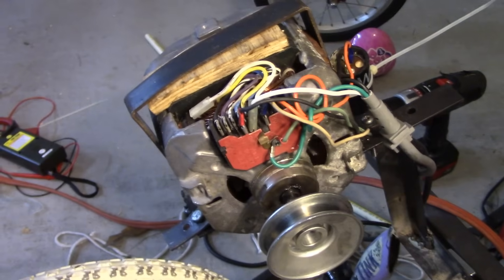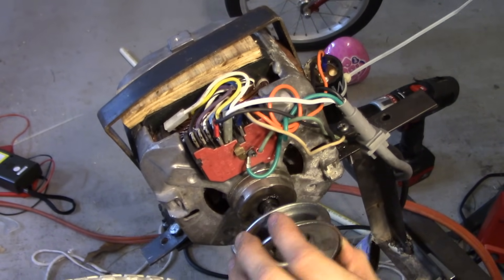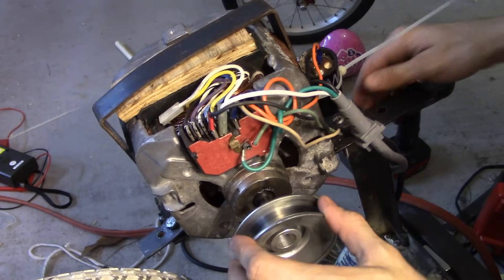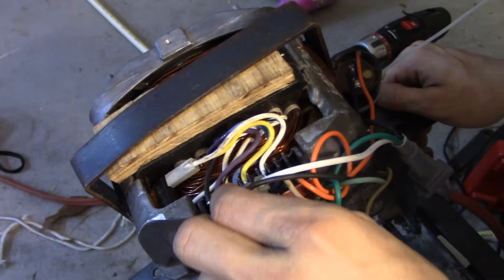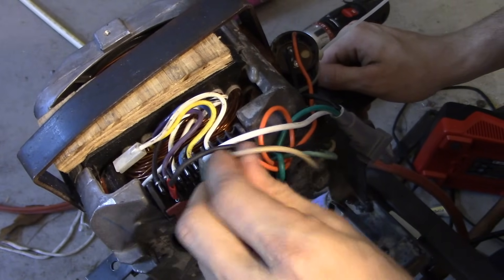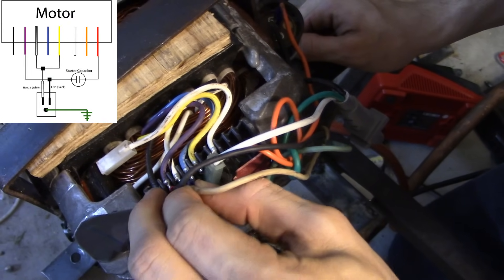You can also run these at a lower RPM. This motor is about 1800 RPM on high speed and 1100 RPM on low speed, depending on which windings you have hooked up. For the high speed it was white and blue, but for low speed you connect black to purple and white to black-with-white-stripe.